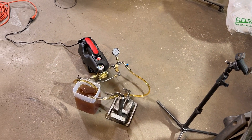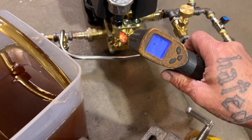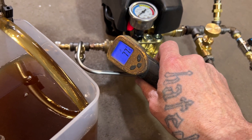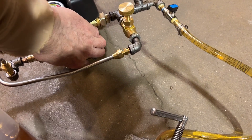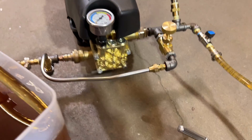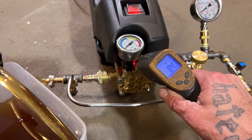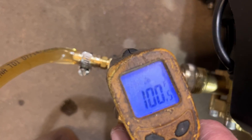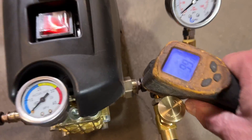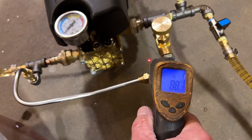This thing has a cadmium dichromate coating on it, and I do not know what the emissivity of cadmium dichromate is, so this reading might not be accurate. You can't just go pointing one of these at anything. It seems warm to the touch — it feels warmer than 71 degrees to me, feels like about 90 degrees. We're getting 85 on that piece right there, but the cadmium dichromate is showing 70. The fittings are showing 100 degrees. So it's somewhat preheating the oil just a little bit, which is pretty awesome. I would imagine once it's been running for a while, that would pick up a bit.